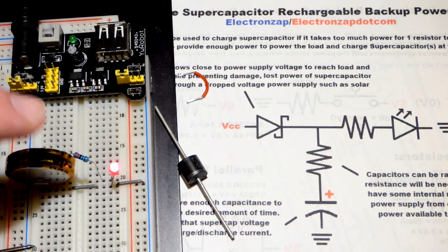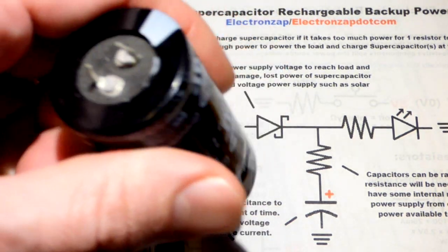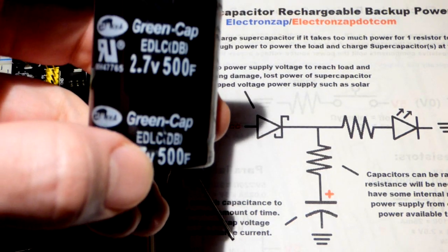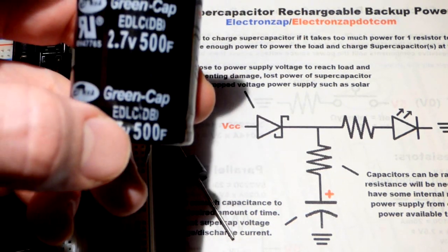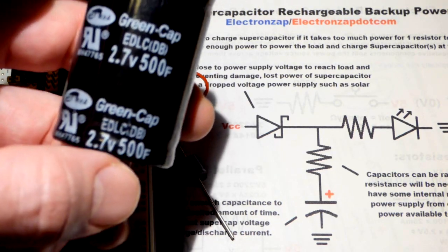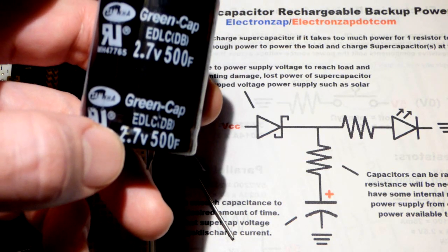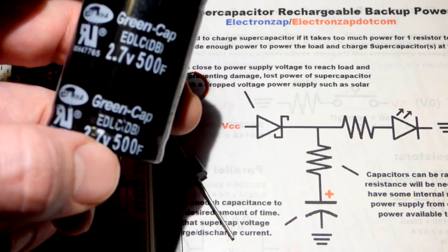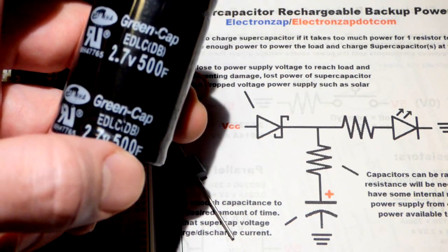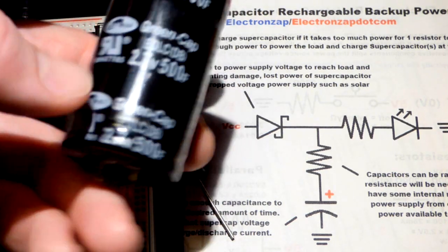If you have a power supply that already has a diode in it, you don't have to worry about that — you can just plug the super capacitor directly to the power supply. These larger capacitors can only be charged to 2.7 volts so you'd want at least two in series. If you put two 500 farad capacitors in series so that you can charge to 5 volts when they can handle 5.4 volts, the capacitance goes down — it's like having a 250 farad capacitor. A 5 volt 250 farad capacitor stores about the same amount of energy as one capacitor, but you can charge it to twice the voltage.